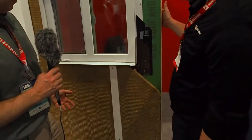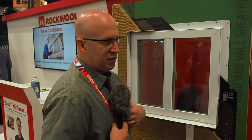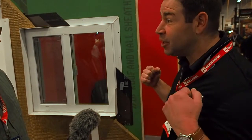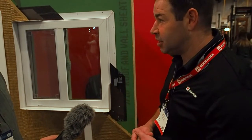So the big question — you've got insulation on the outside. Like wearing a jacket on the house is better than trying to shove insulation into your core. When you do that, do you need extra insulation on the inside? You can actually reduce the amount of interior insulation by putting up more exterior insulation. And being vapor open, it's like putting a flannel jacket on — not a plastic bag. It's not a vapor barrier like a lot of the foam and other plastics people are putting on the exterior.